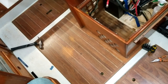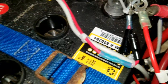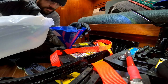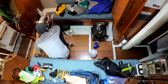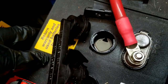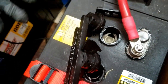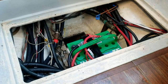I've got the diesel tank all put away and now I'm starting to put the batteries back in. While I'm at it, I wanted to check the water level in the batteries and add some distilled water. After the batteries were back in place, we decided to do a thing called equalization. Probably twice a year, you have to do this — basically, the battery charger puts a high voltage into the batteries, which does something with the plates where it releases a film that gets on them. This applies to flooded lead-acid batteries, which is what we have. We actually have to keep the whole place vented because this process produces hydrogen gas, which is flammable.